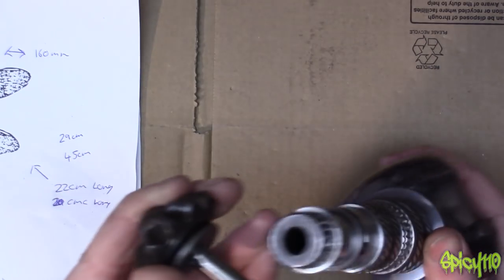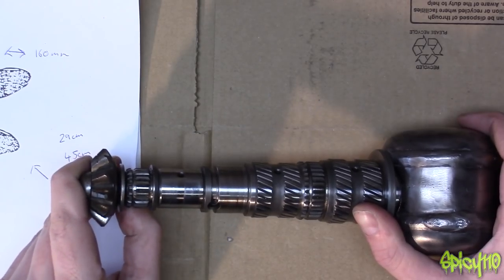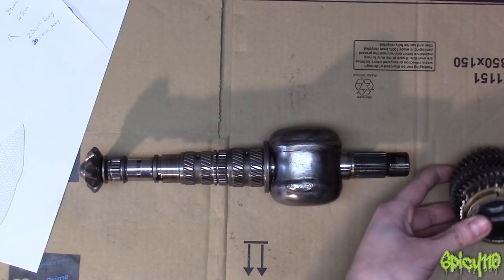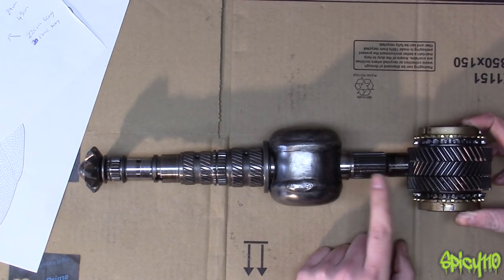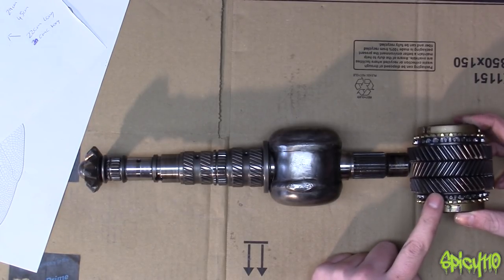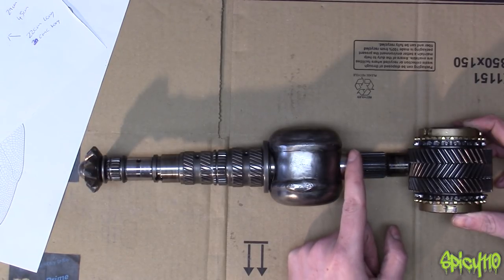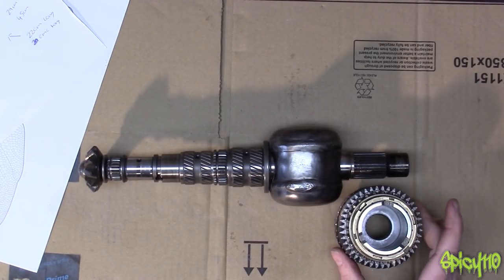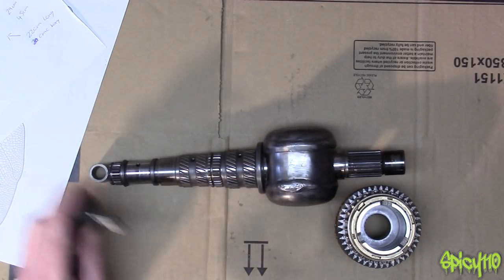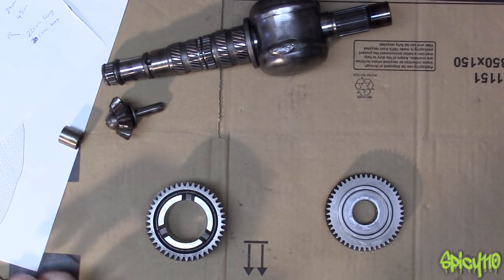And then that goes as a hole here and this goes in here. How I'm going to attach this in here I don't know. If I can put a spot of weld on the underneath, that would be ideal. But I don't know what this is made of — I'm assuming it's steel, so I'll probably give it a go. So that's the basic body and then we've got the head. Obviously that head doesn't belong out here, it belongs somewhere back here. The first thing I'm going to do is weld this head together so we've got it in one piece because it's difficult to work with. I'm thinking I'll probably end up cutting it off around here and then I might actually shape the shaft with a bit of a U shape to try and fit around this and then weld all the way around it. What I do know is this head needs to be welded together — it'll make things a lot easier. We can work out the rest from there. I'm going to weld that tail up while we're at it. So actually the first thing I need to do is clean these with some acetone just to make sure I get rid of all of the grease so we have no contaminants when we're welding.